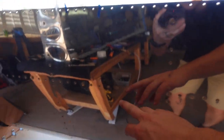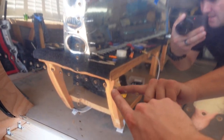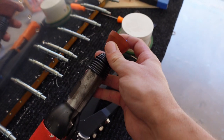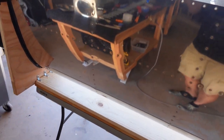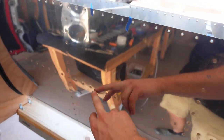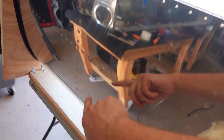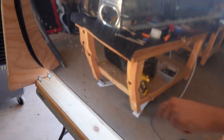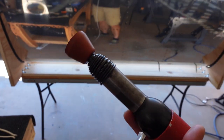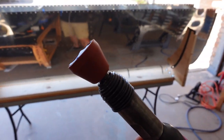As far as the front side, I did have a little bit of an oopsie, which in the grand scheme of things is minimal. You'll see where I was using the non-swivel, non-rubberized head — that one is generally my preferred method. But this was one of the first rivets on this J-stiffener and normally I'm pretty good about not having it slip, but it slipped on me and I had no time — my reflex wasn't there. So a little bit of a kiss mark there, but minimal. As for what I'm using going forward, just using the swivel head with the rubberized cap on it.